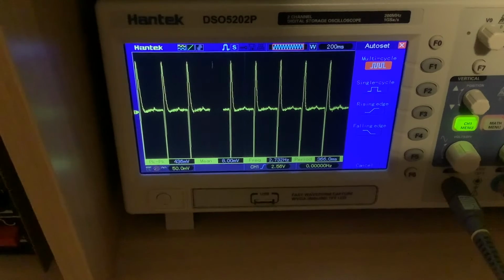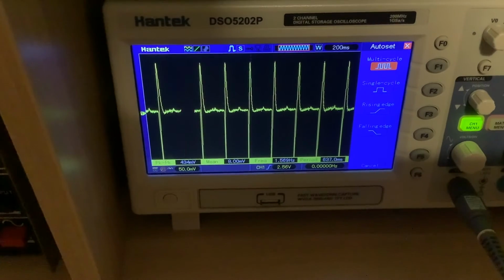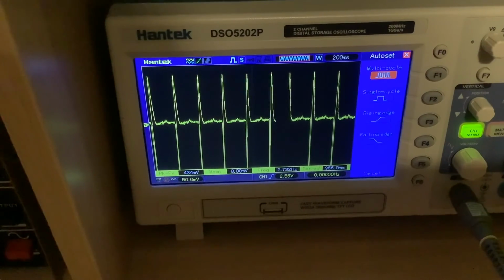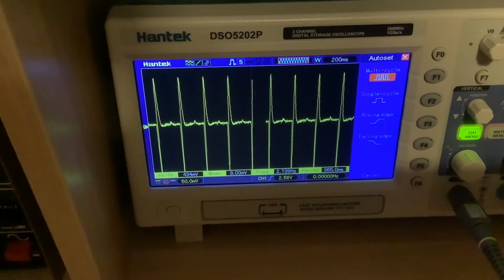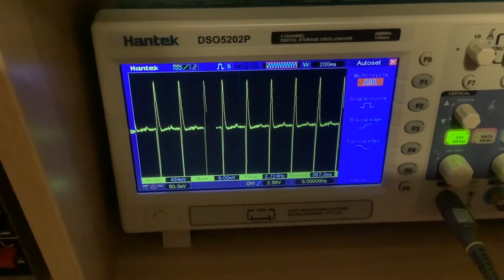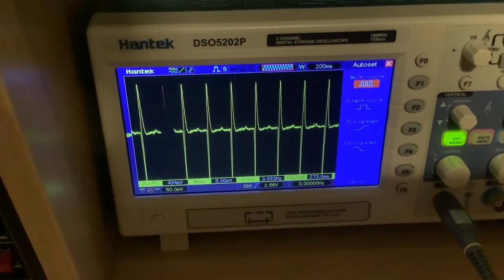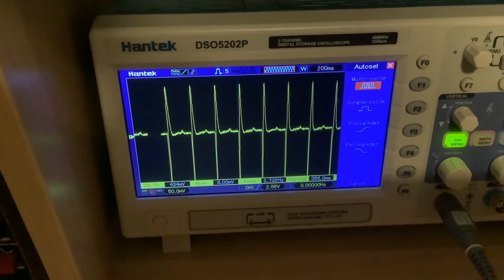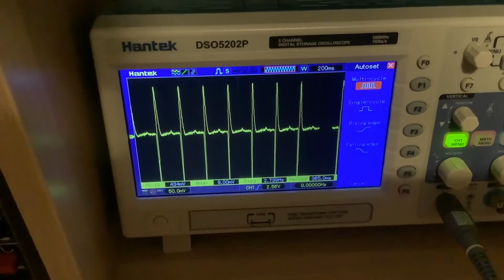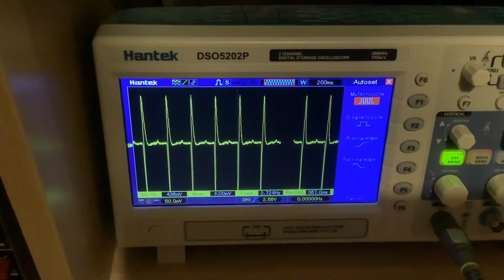And I thought, well, what on earth is causing this? And I tried a few things. I tested the SSM 2167 board on its own, and I wasn't getting this. So I knew that the problem had to be with some of the additional circuitry that I've built around it to use it with a microphone. I tried a few things, more capacitors to ground and various things, and nothing worked at all until I tried this. Now, just a minute, get a load of this.